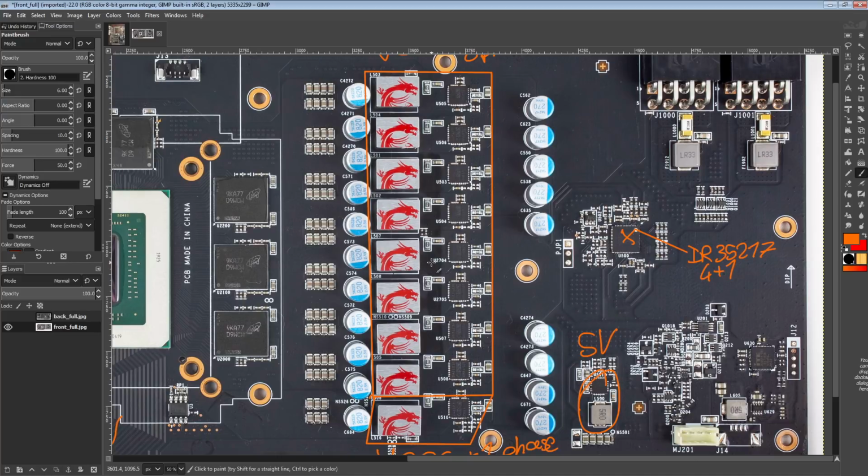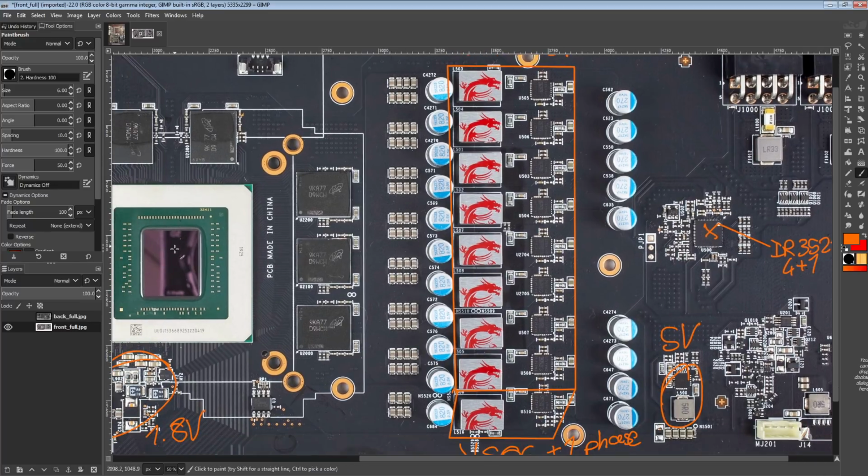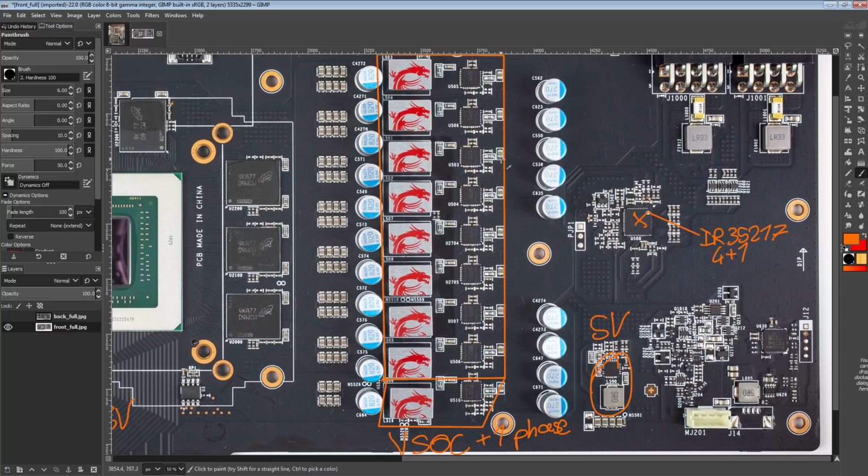The pulse that's most delayed is exiting tri-state. That's the transition that takes the longest for the doublers. And tri-state is only really a concern if you're going from idle to full load. Normally by the time you get to a loading screen on something, the VRM will already be running all of its phases at that point. Basically the GPU will tell the VRM to go to high performance mode long before you actually hit full power draw. So that's worth keeping in mind.